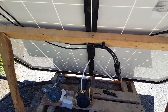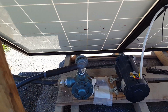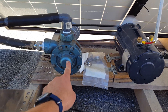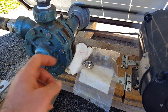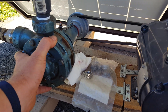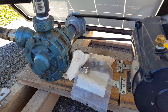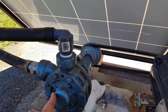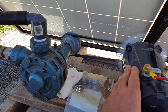This is how I'm going to solve the problem — pretty excited about this. A couple quick lessons learned: one was I tried running this pump yesterday dry and realized there are some packings in here. There's a little turbine blade inside, and the packings obviously required water to run properly. I got water in it now; it's well lubed up. Yesterday it seized up and the thing wouldn't even run.